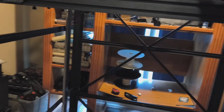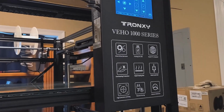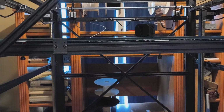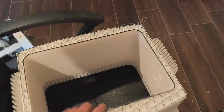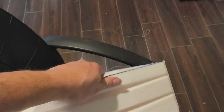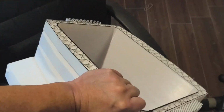So what I'll do, change the print head to the new one. I'm going to put the jumpers back in the control box where they were before, and then of course, as I'm changing the print head, re-level the whole bed while I'm at it, and then get on with printing Marvin from where this left off. So I need to work out perhaps a good position where to start the next print, and then join them together. So I don't really want to waste all that bottom piece.